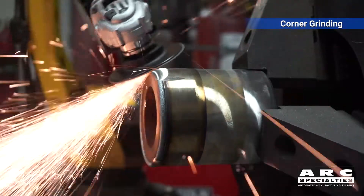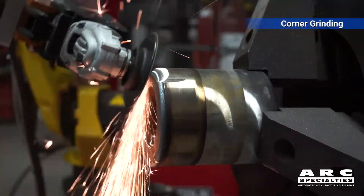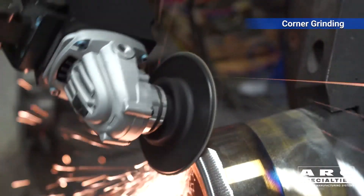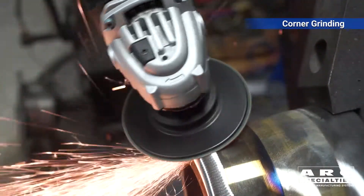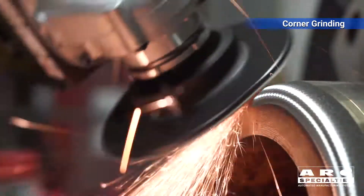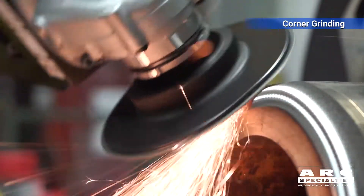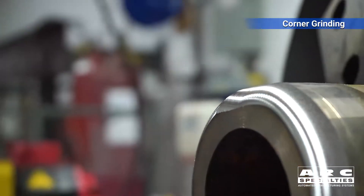In this case, Bob has created a two-horsepower angle head grinder with pneumatic compliance built in. The beauty of pneumatics is you can change that force on the fly by using a variable regulator. The whole thing runs at about 8,600 RPM, and we're using a quick-change hook and loop system to fix the abrasive onto the disc.